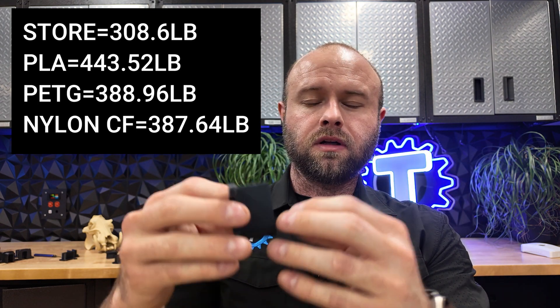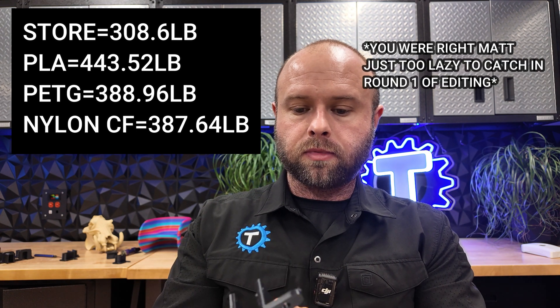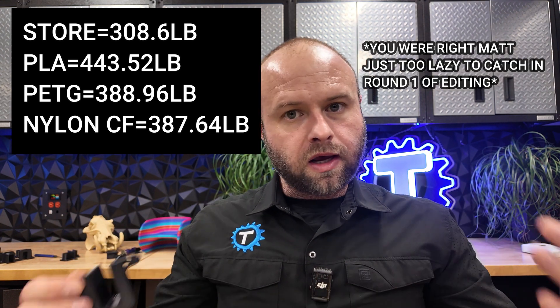The 3D printed parts are certainly stronger, though not by a long shot — and I was really surprised by this result. I thought for sure that at 100% infill, being thicker, they would have clearly outperformed the store-bought bracket, but that's simply not the case. It's almost as if when they engineer those things, they engineer them to perform well versus an ad hoc thing that I designed. We found that all of these performed in that almost 200 pounds per bracket range. With four brackets, you'd have 800 pounds of capacity — nobody is putting 800 pounds on a wire shelf in a closet. The biggest load is probably some clothes or storage items, maybe 100 pounds max.